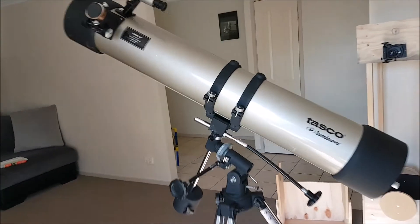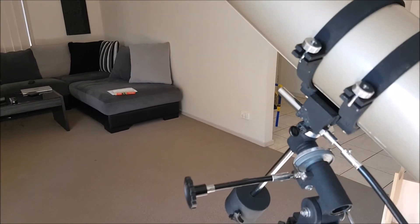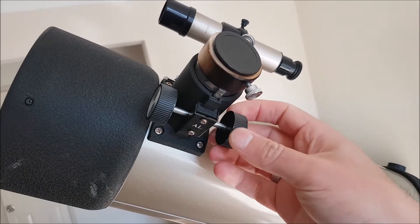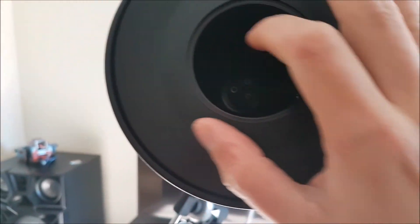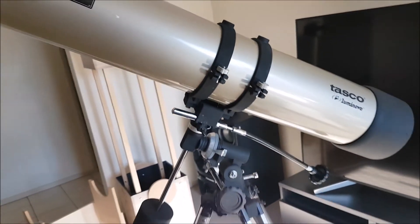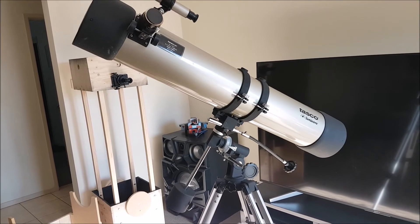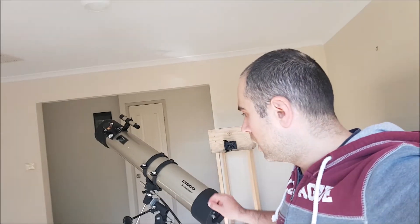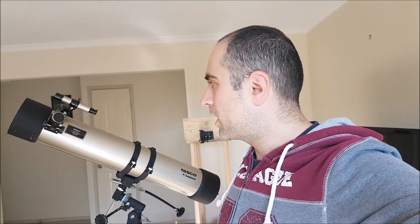All the work is complete on the optical tube. As you can see I've just reassembled it — it's all looking really good. Smooth transitions from RA and declination, smooth controls working really well, the focuser's been fixed, and both mirrors have been cleaned and collimated. I tried to get rid of as much dirt as possible; the rest are just nicks and scratches, nothing I can do about that. The telescope was tested last night against a few astronomical targets and the views were very impressive. Thanks for watching — this video is a really good example of how you can restore an old piece of optical equipment and still get much use out of it. You don't have to buy anything brand new; if you're happy to buy something a little older and used, just bring it up to a working standard and that should really suffice.